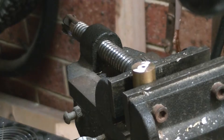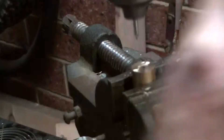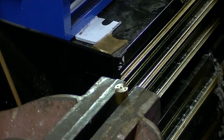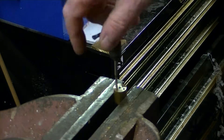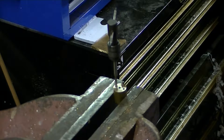Now I'm going to start by drilling these holes into this end vertically, and I'll begin with a centre drill. Always have to make sure these are nice and tight when you go into brass and you cut gently. My drill is a bit off-centre, but because the centre drill has started this process it's fine. Now we've drilled those holes and I'm ready to tap a 3mm thread into these. This is why I want plenty of meat in this end part — so that I can not only drill the threads easily, but the head of the screw won't touch the shaft when it's done.